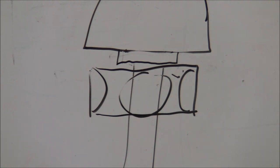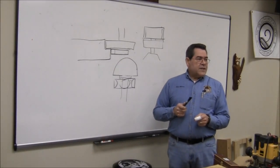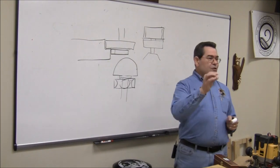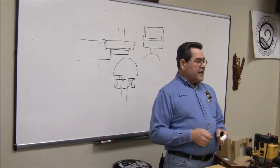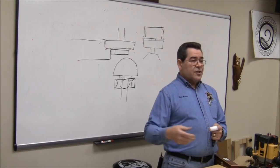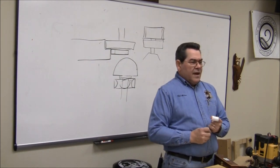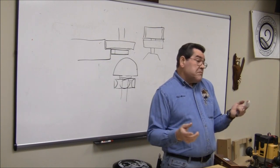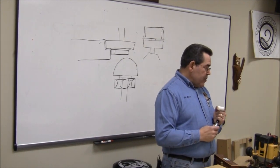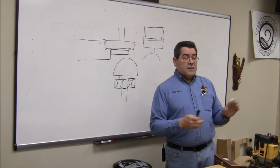CMT's Mark Summerfield gives a demo on door-making with their sets. One of the things he does is take a little space ball, drop it down in the router, then drop his router bits down into that collet. It hits on the space ball, he tightens the collet, and he says the bit will always be in the right position. It seems to work for him. If you want to buy CMT quality bits and pay their prices, that may work for you. If you're frugal and getting your bits from China or wherever, I wouldn't recommend it.